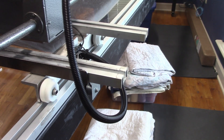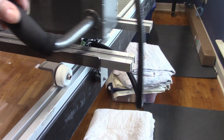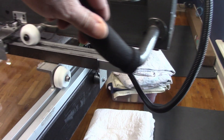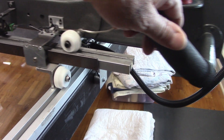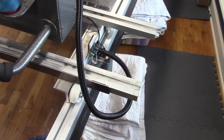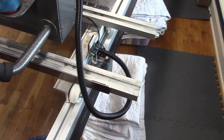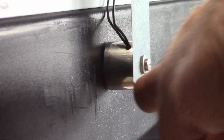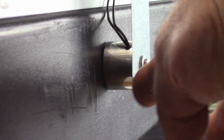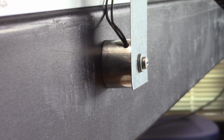You need some type of flexible system there because the machine moves quite a bit back and forth. On the other side there's a system that manages the power cord, but there wasn't any room to add this, so I just added this little piece of flexible pipe here. This is the magnet on the back side — you can see it moves on that piece of sheet metal that acts as the hinge. Let me engage it for you — you can see how the magnet jumps forward and grabs it.